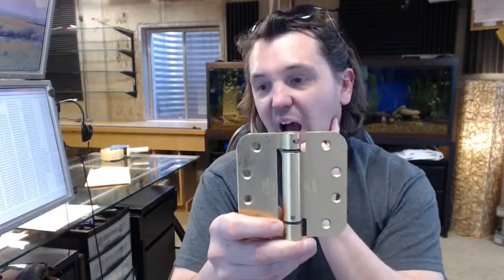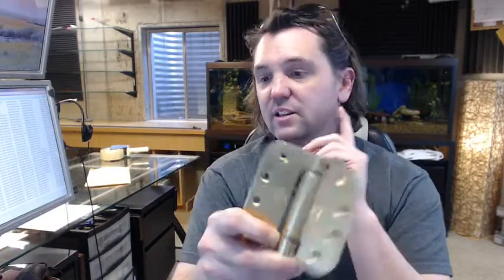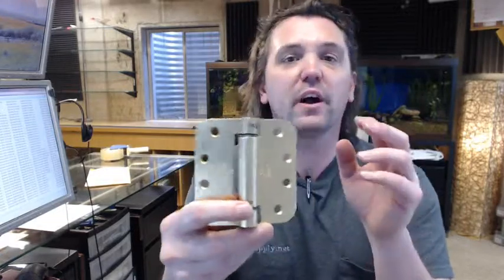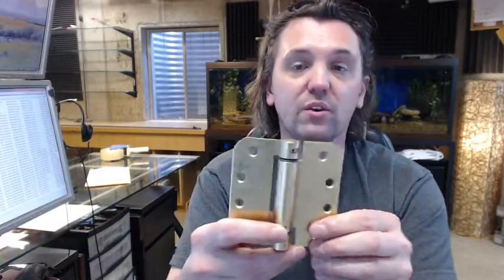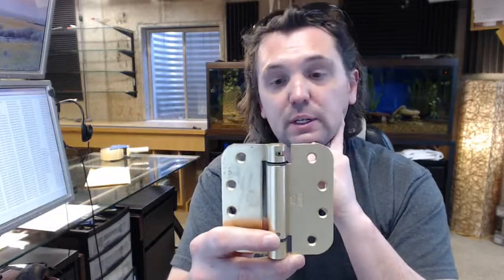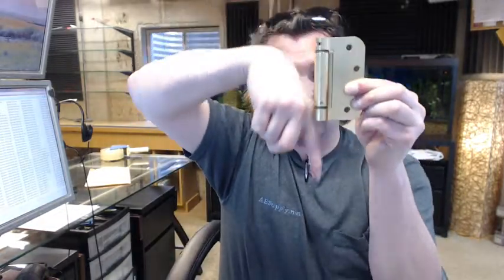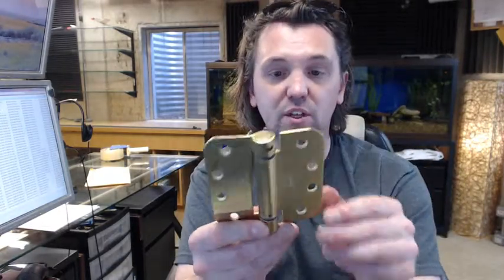There is a guide below this video to how many hinges you need depending on the size and weight of the door. First of all, they're talking about doors up to 3070 only. Okay, so if you're working on doors that are 85 pounds each, 2 spring hinges they recommend, and the axis of pivoting of the hinge axis is compatible with mixing it with the standard 4x4 hinge. Wouldn't be a problem. If your doors get up to 110 pounds, Bommer recommends 3 of these hinges.